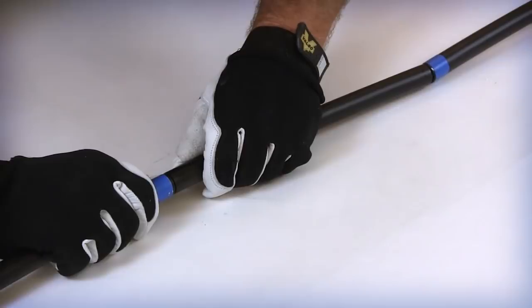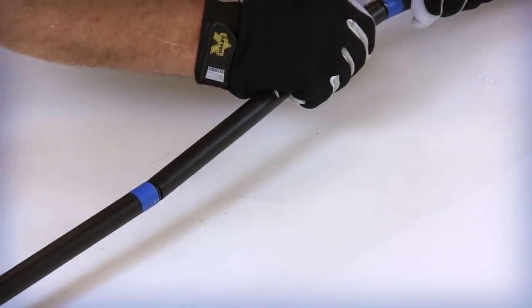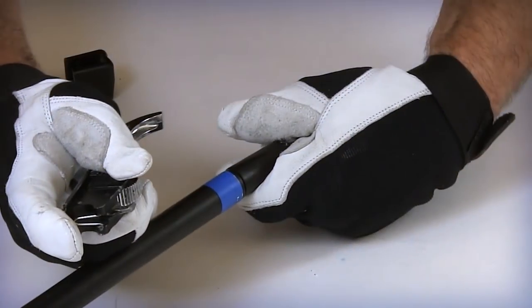Flex the jacket surface at each of the two ring cut locations. This process should separate the armor between the inner and outer jackets. While wearing specified protective gloves, remove the cable guide cover from the armor entry tool.